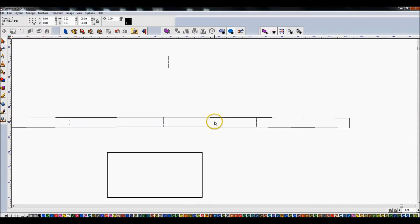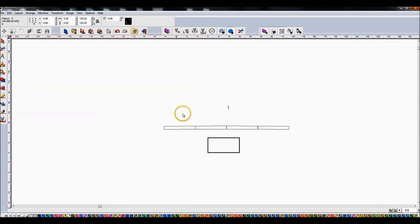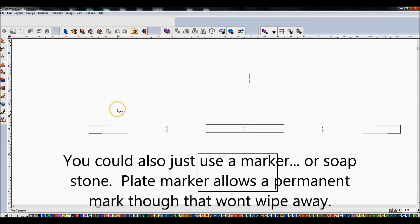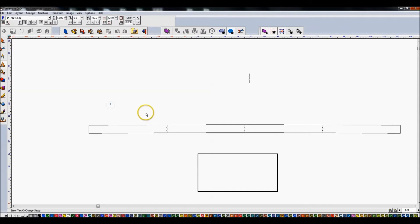I do want to keep track of where these sections are at because I put a curve in this — if I left it straight, it wouldn't matter as much. So I'm going to do a numbering on them. I have a plate marker — you wouldn't have to do this with a plate marker, you could cut it out with plasma, but I don't want to mess with the integrity of this beam at all. So I'll come in here and give myself a number one.